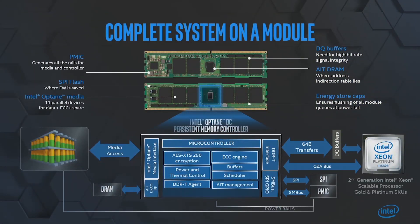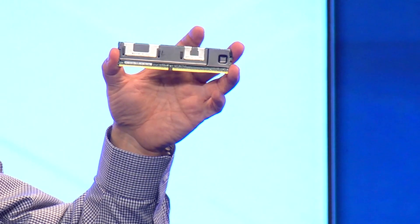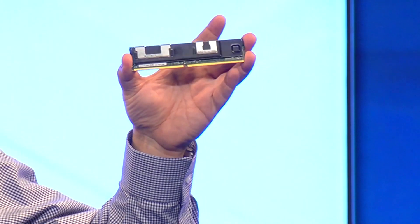This controller is a piece of SoC. This controller has a microcontroller on it with its own firmware, but we couldn't let the firmware be in the data path for reads or writes. So we have implemented everything in this controller in hardware, and we just let the firmware on the module handle media management as well as some exception handling.